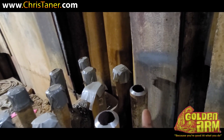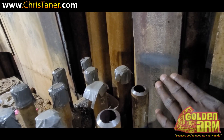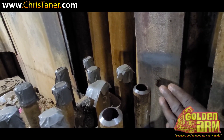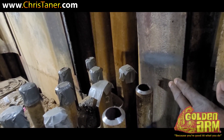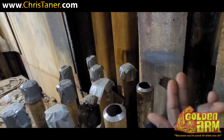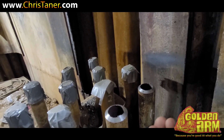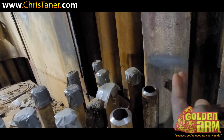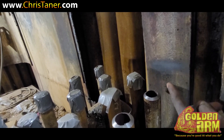If I'm in an extremely tight spot, I'm going to use a tight 3/32 gap, preferably a 3/32 wire. But if I'm running really high heat, I'll use a 3/32 gap and a 1/8 wire. My amps will be at 126. If I'm trying to go real fast and really want it melted and done, I'm going to have my heat at 130 — 3/32 gap, 1/8 wire at 130 amps. You're going to be sure to melt that beveled edge, the wire, and the top beveled edge. Just go with it.